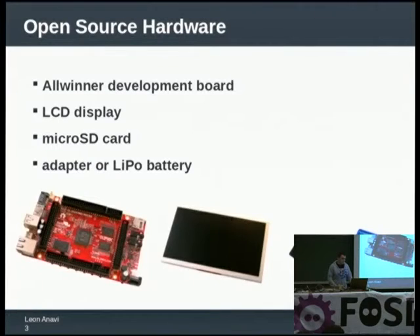These types of boards boot from a micro SD card or NAND. My personal recommendation is not to buy a NAND board if you are planning to port a Linux distribution, Android distribution, or Tizen on it, because it is much easier to work with a development board that boots only from a micro SD card.